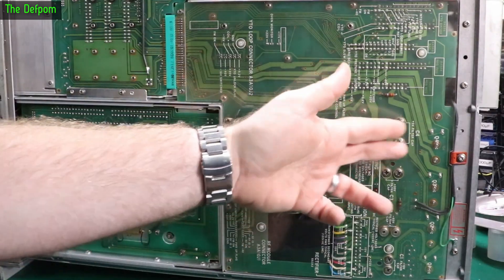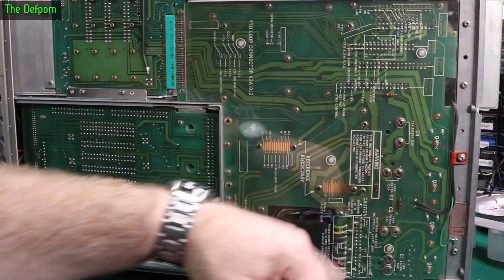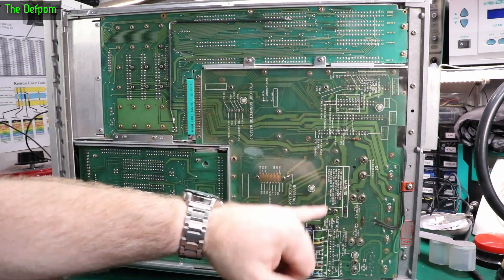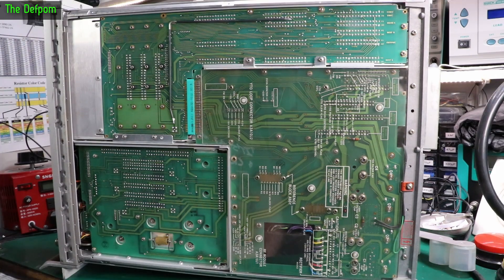These caps need to be replaced so I need to find out what these spacings are. There's a 5V filter cap, 20V filter cap, minus 40V filter cap, and minus 10V filter cap — the voltages are marked on here as well. All I need is the screw-in type. I don't have the screw-in type caps — all of my ones are solder types.